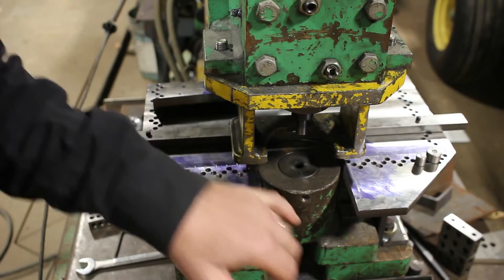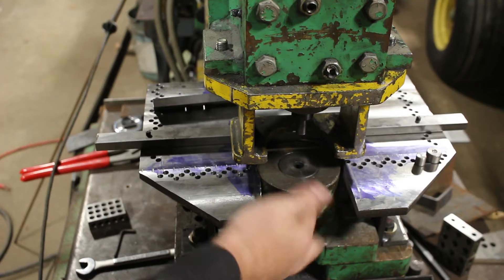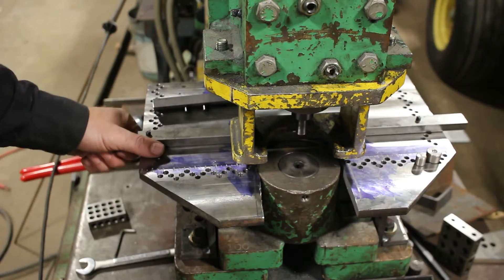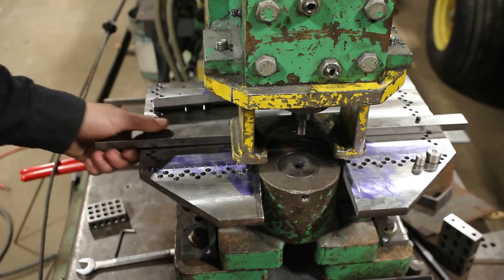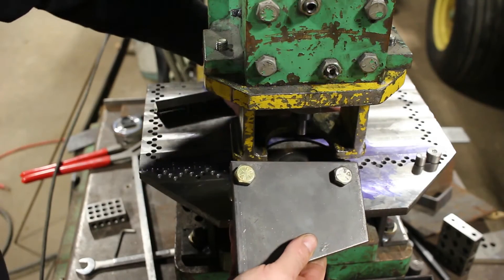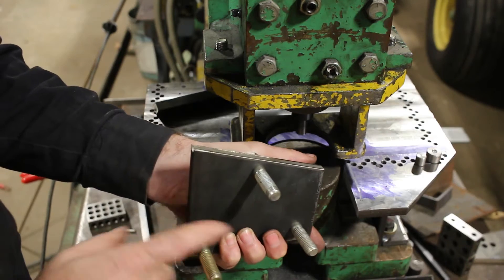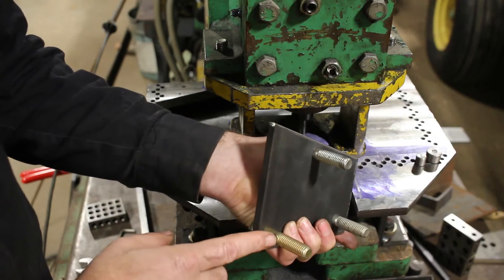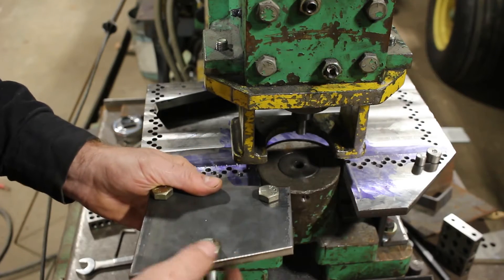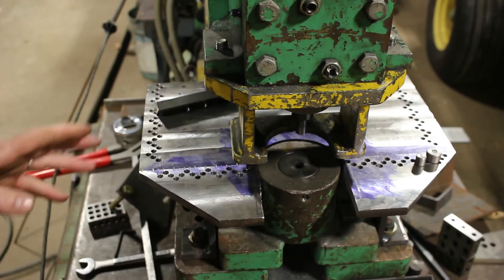I do have a little apprentice mark here from cutting these out. The other thing about the Uni-Hydros is they just have a circle here, which is easier, but then to change the dies you have to take the table off. You're also probably wondering how I get the table aligned to the punch. I made this piece with two big holes in the back that these two pins drop into — I'll probably replace the bolts with regular pins since the bolts are too long. Anyway, this drops in here, one goes in the middle, and that gets me referenced to the center of the die, so the table is set and locked in.